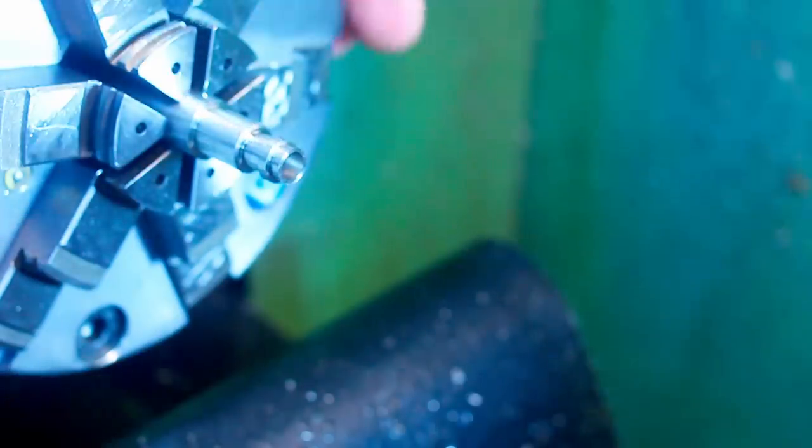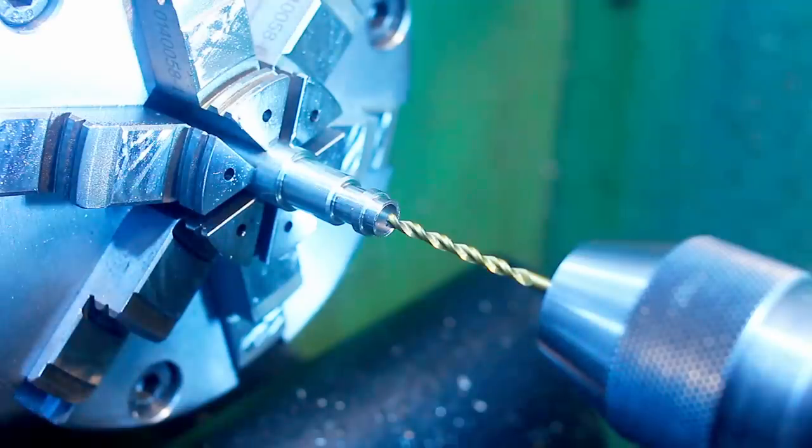I hear you, but Stefan, you have 50 micron plus minus tolerance on this bore. And why are you shooting that precisely for a nominal size? Well, the answer is simple. Good practice for me. Each time I shoot for a precise dimension like this, it's a little bit of training and I just get in the habit of working precisely. And it is good practice. That's the reason why I'm pretty okay on the lathe at hitting dimensions and having little trouble hitting dimensions, because I do it all the time, even if it's not 100% necessary.